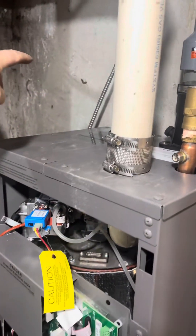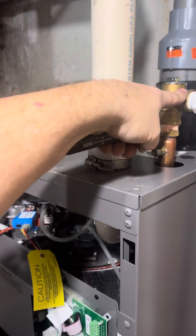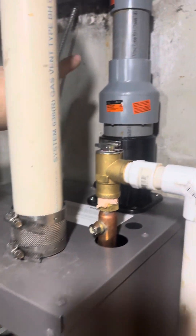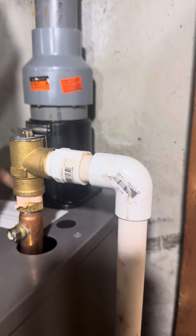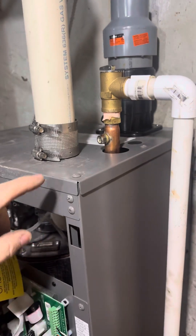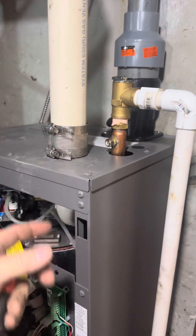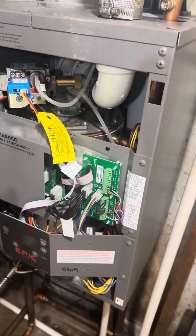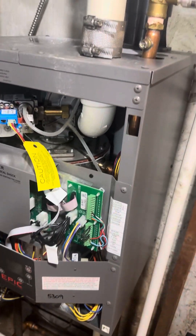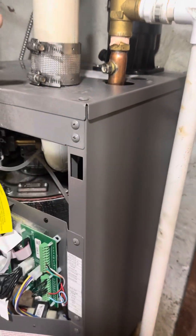Once you've done that, you're going to remove all the screws around the top panel, disconnect your venting, disconnect your relief valve, disconnect your exhaust vent. Then take these four screws out — though I don't find much use in that — because when you remove the entire panel it will come out and pull the flue collar, which runs at the back and down into the vent collector at the bottom. It just pulls out, and you're going to set that aside, giving you this entire opening open.